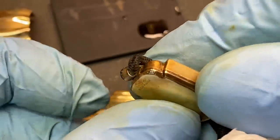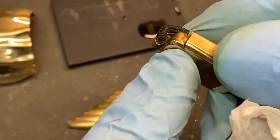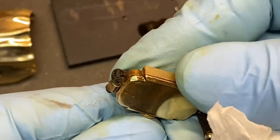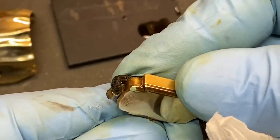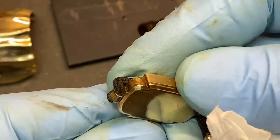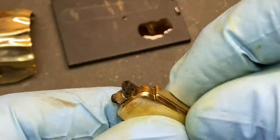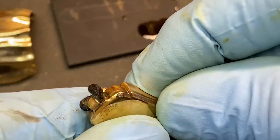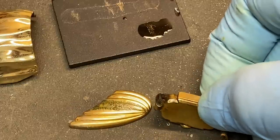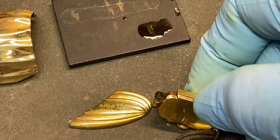And that's how we test for gold-filled material. If it's not marked like this one is, we just file a little bit off and then dip the file mark into our acid and watch what it does. The acid immediately begins to dissolve the brass that's underneath that karat gold — turns green, starts bubbling. When you wipe it off you can see a distinct border between the two metals. This concludes the video that demonstrates how to tell the difference between gold-filled material and gold-plated material. Thanks for watching.